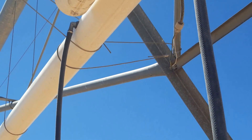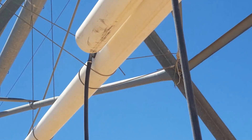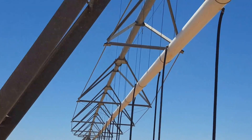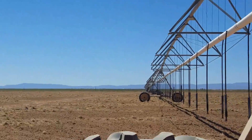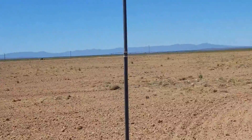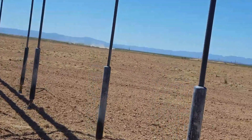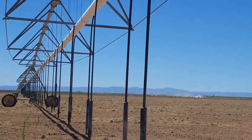You can see the cables running over to the leg. We like to do that every so often just to keep our PVC hanging centered underneath the pipe. If you get wind like we do, or if you're going on slopes, your pipe can get hung offside and that can pull your pivot span over. So it's a good thing to anchor it in the center.